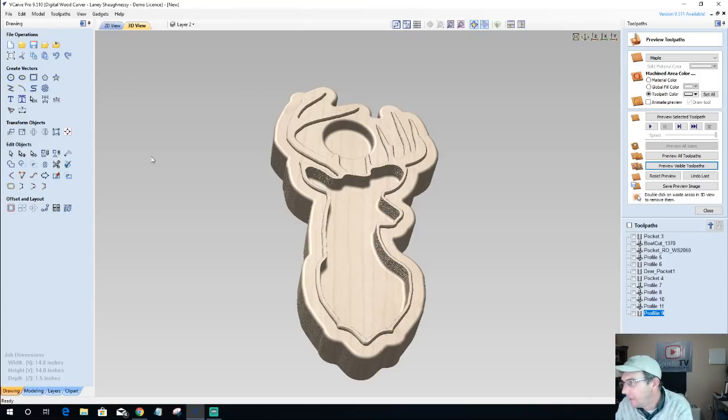Show of hands. The flat depth, William, is 0.625 inside the main pocket here. But at the top surface here, it's an eighth of an inch. It's bringing it down an eighth of an inch just to get some definition out of the outer profile. So the flat depth is an eighth of an inch on the outside, 0.625 inches on the inside. On the 90 degree chamfer, the flat depth is an eighth of an inch. We're cutting a 90 degree chamfer down to this level here.